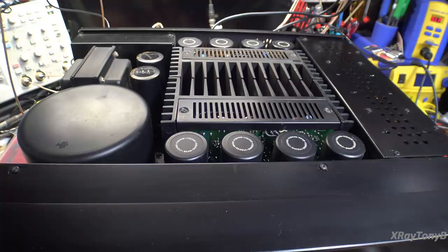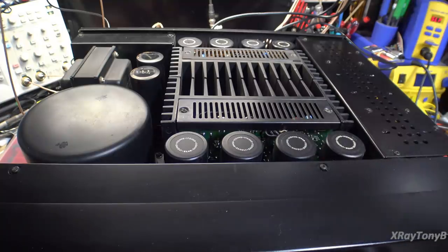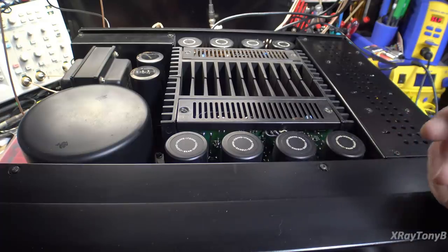And even though an amplifier can have good characteristics with that test, most amps will pass that test pretty well. There's a lot of things that can affect it, though. For instance, you saw me using that Keithley 2015. If I use the built-in signal generator in the 2015, the lowest distortion I can display is about 0.02% total harmonic distortion, because the actual sine wave coming out of the internal signal generator in the Keithley actually has its own distortion component right in that fundamental.